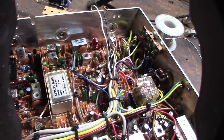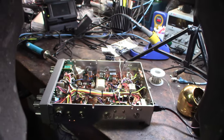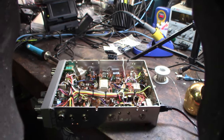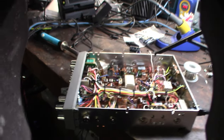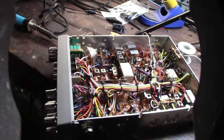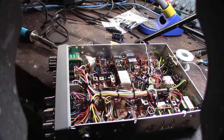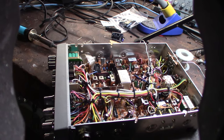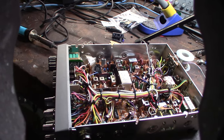All right, so that's how I recapped it. Pretty cool kits. I'll put a link down below. Klondike Mike sells them on eBay, and I think on Amazon too. I actually bought it from his website directly, because this motherboard, the 176AD, he didn't have listed on his website. So the kit was for the 176AA. Even I couldn't find a schematic for the 176AD.